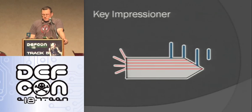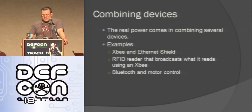Like I said, all you do is connect power to the outside of the lock, just the body of the lock, and then you connect all these wires coming off the back of this to your Arduino, and you just see which one's giving a high signal coming in on a digital read, because that's the one that's actually being hit. The body is giving power, so it goes through the body of the lock, through the tumblers, and into the device.